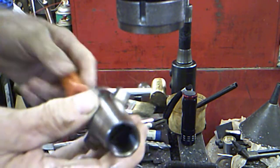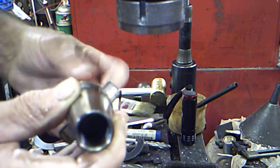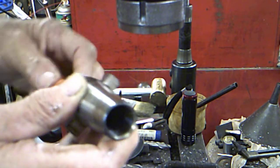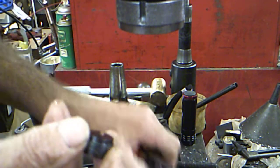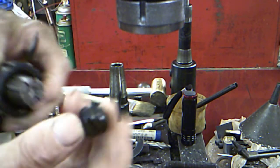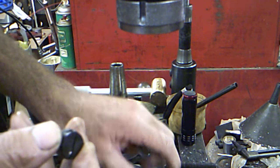See that screw? For some weird reason, this thing was all the way down in the hole. I'm going to show you something here real quick. This, for whatever reason — and I guess it's some form of a stop — is the same size as the collet, and it happens to be larger than the shank of a three-quarter. What I discovered was it was all the way at the bottom of the threads inside this adapter.